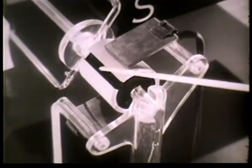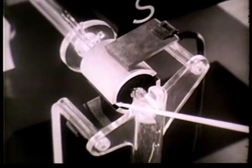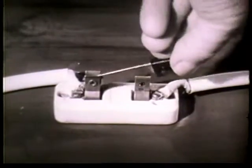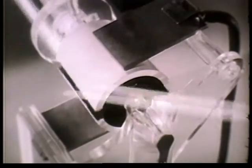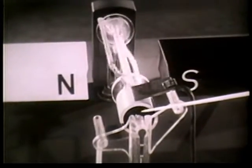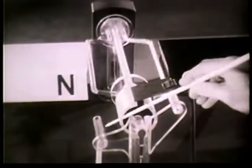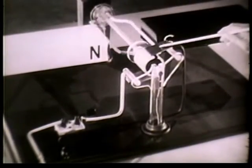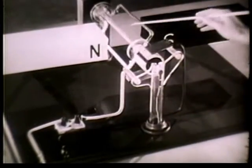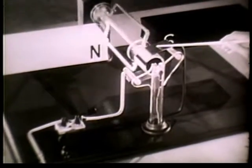This is the job that is done by the segments and brushes. The segments are made of copper, which is an excellent conductor of electricity. Each segment forms a half circle and is connected to one side of the loop. The segments rotate with the wire loop. These are the brushes. They remain stationary while the wire loop and segments rotate. Every time the loop rotates a half turn, each segment disconnects from one brush and connects with the other. The brushes are wired to the source of electric power — the battery. When the switch is on, current always enters the wire loop through one brush, then returns to the battery via the other.